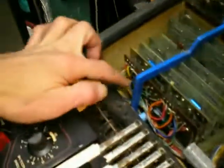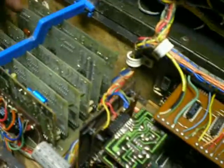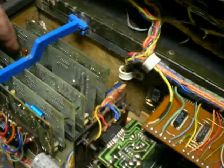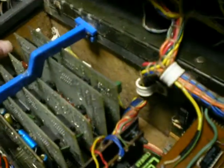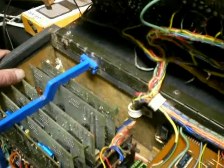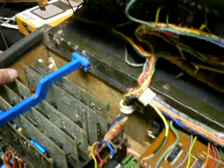I've added to my documentation the fact that there is a wire here — this orange one comes actually from this key switch, and it goes under and down to an op-amp which was bad, half bad — a 348 quad op-amp on the DAC board. I looked that up, but my brain is fried from just too many problems with it.